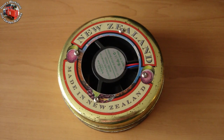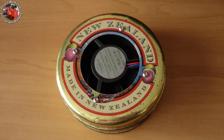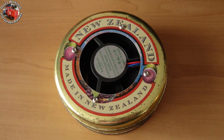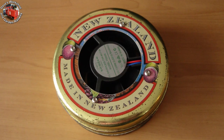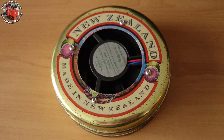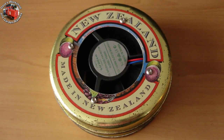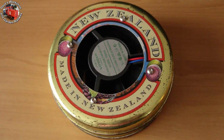Here's the body — a boiled sweets tin, with a 57mm diameter cut-out for the 60mm fan. It was a mission cutting it out. I marked it out with dividers, drilled it, used the piercing saw with an 80 TPI blade, then dremeled it with my Ryobi to the scribed line. The fan was then lined up, clamped in place, then the four holes were drilled through for M3 screws.